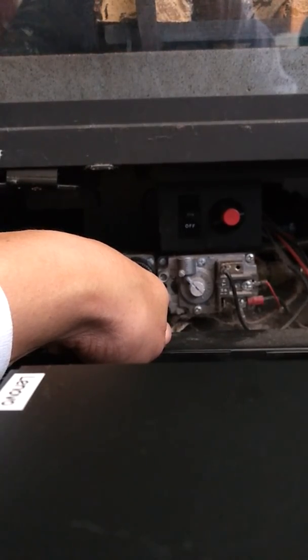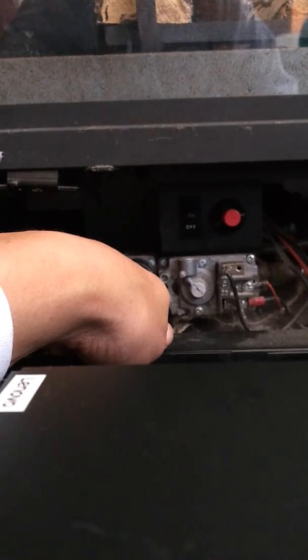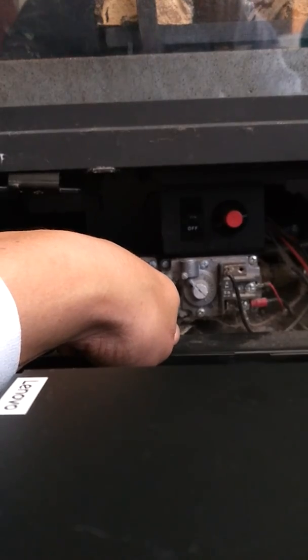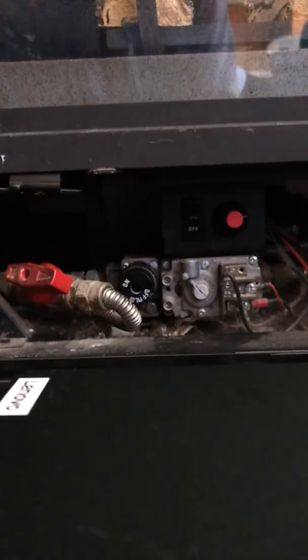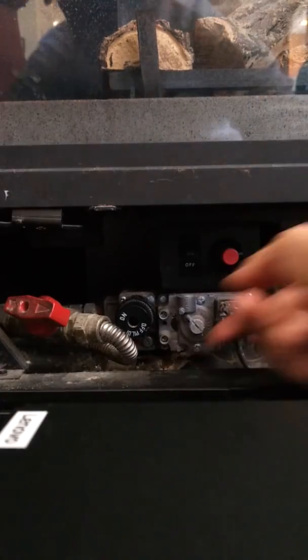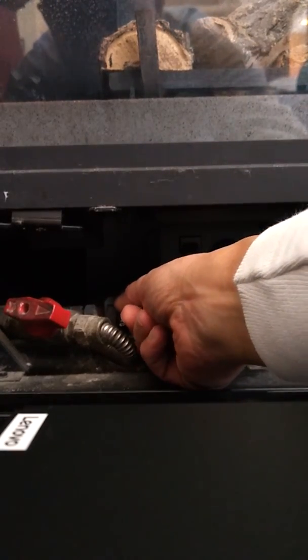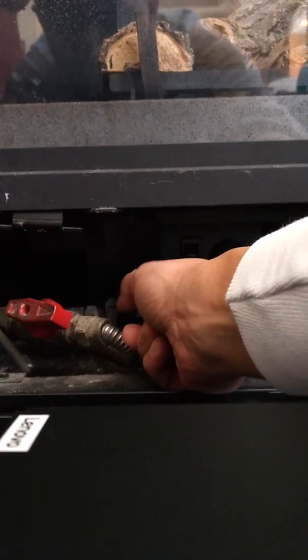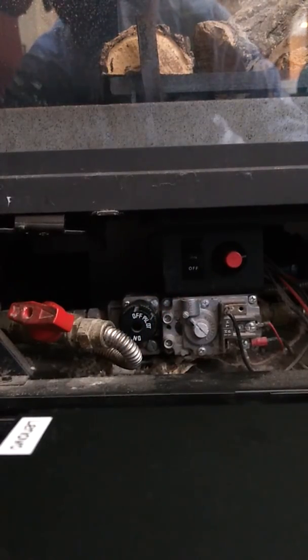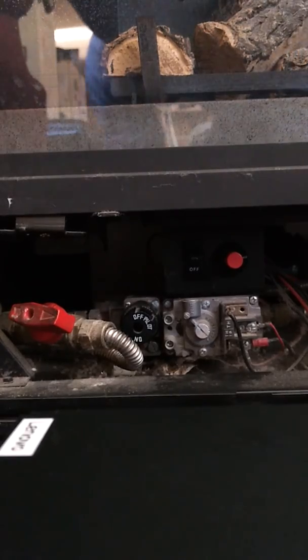If you let it out too soon, the pilot light may go out, and then just push it back in and re-hit the igniter. So we're gonna slowly let it go. And we'll check and make sure that the pilot light's still on, and it is. Okay, so now we'll turn this all the way counterclockwise till it stops rotating, and you see on is in the down position. So now it's ready for use. So the pilot light is on, and this is the way it'll normally be.